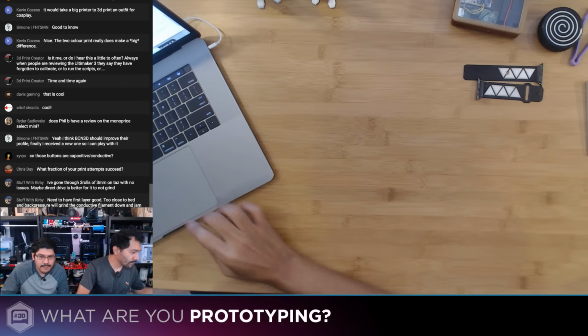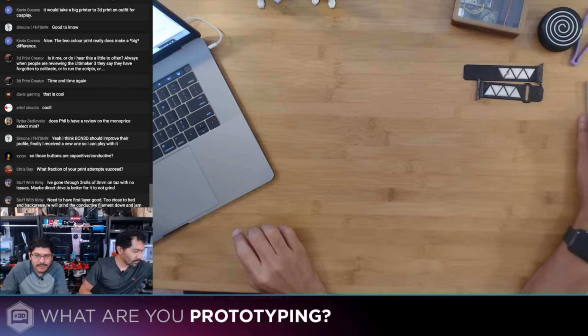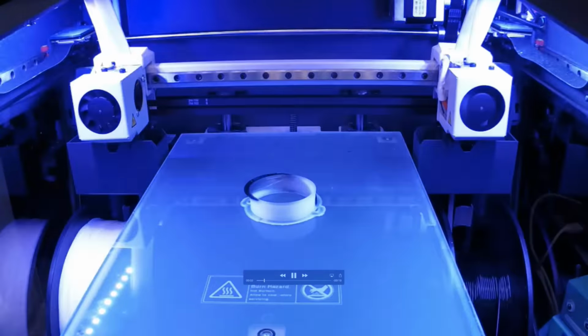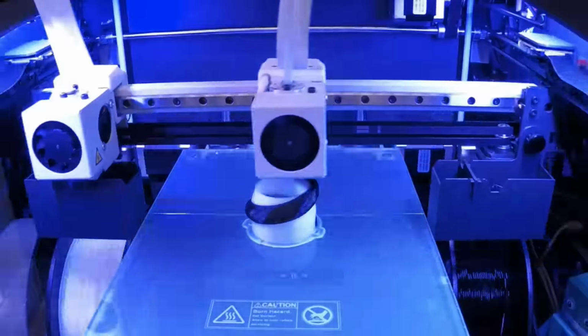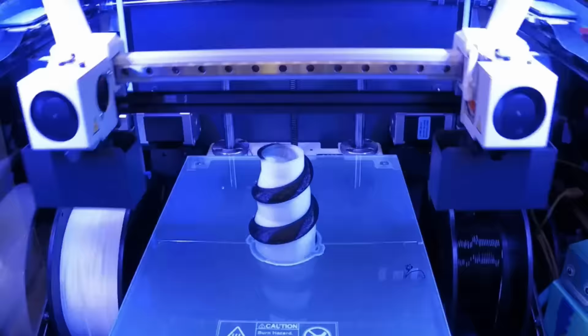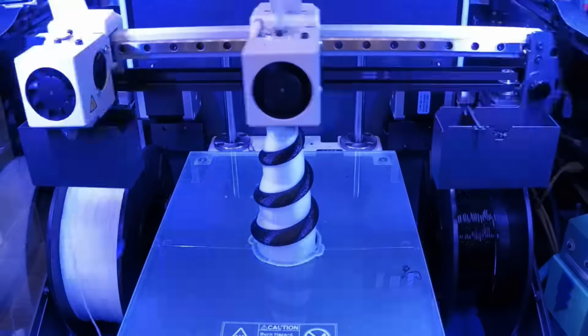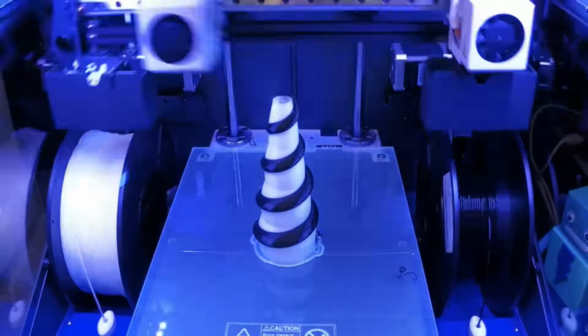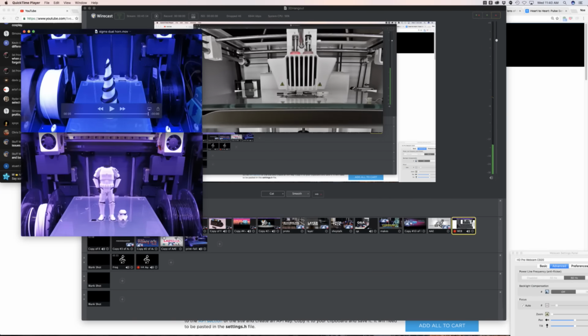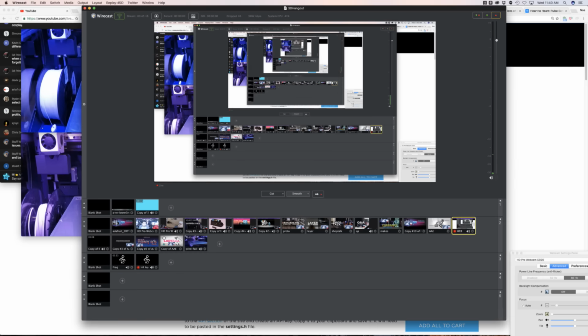Yep. Like Paige was saying, I've got one last video I want to show you guys. This is a dual extruded unicorn horn on the Sigma using 1.75 diameter PLA filament, with no prime tower, no ooze shield, no waste, and zero contamination. A little bit of a problem at the tip there, but look how clean that is. It came out really nice. Wow. So it just depends per model. It's not like we haven't got good prints on the Sigma. So yeah, it's vice versa for both.